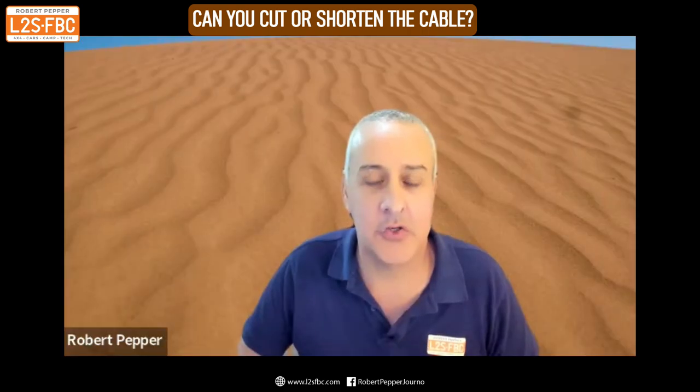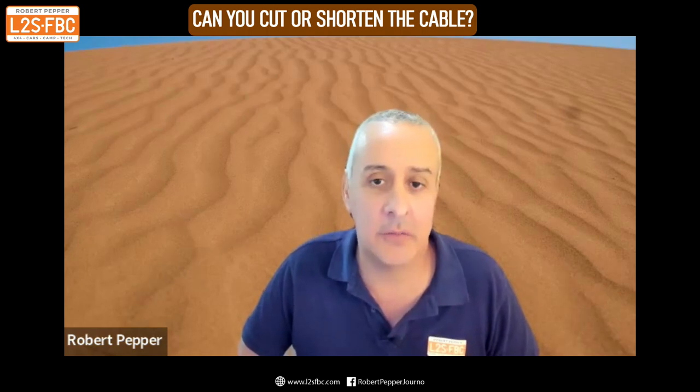Question from Josh Hayes: has anyone cut the gen one cable to reduce the length? I've got an RJ45 ethernet socket on the outside of my house and I just plug Starlink in and out, using a cat six cable to my router. I haven't cut it myself, but I don't imagine there'd be a problem. Marcus, have you cut the cable? Yes, I've cut mine down. I had a gen one in Canada, but when I got a gen two for the US I sold the gen one to a Canadian. I was averaging about 100 watts of power on the gen one — I chopped 80 feet of cable and that reduced my power consumption by 5 watts.